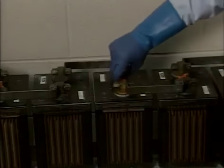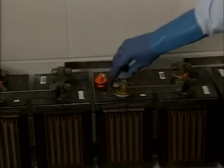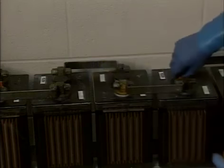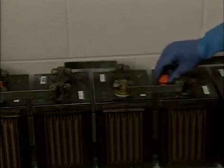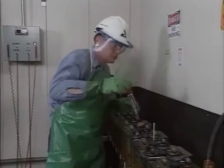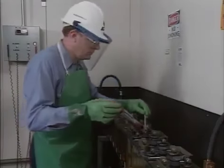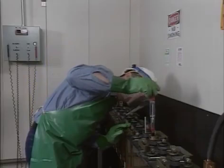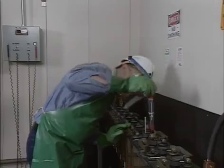Before a freshening charge is applied, the cells must be properly installed. In addition, the shipping vent plugs are typically replaced with flame arresters. Also, the electrolyte levels are checked to make sure that they're above the top of the plates. Water is only added if the plates aren't covered, and then only enough is added to cover the plates. Of course, when you're performing any kind of work on a battery, be sure to wear the appropriate protective gear and follow the required safety precautions.